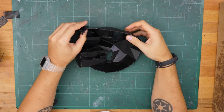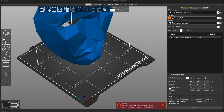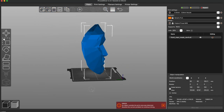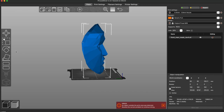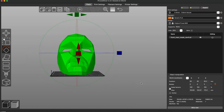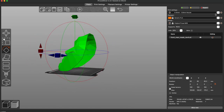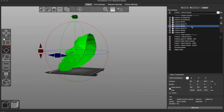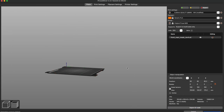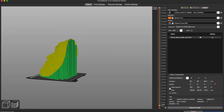At first I was a little worried because the mask actually didn't really fit on my build plate. What I did was tilt the mask just slightly to the back and then suddenly it fits. The problem is that if you print with generic settings, mostly almost default settings from the Prusa Mini, you're going to end up with a lot of support.